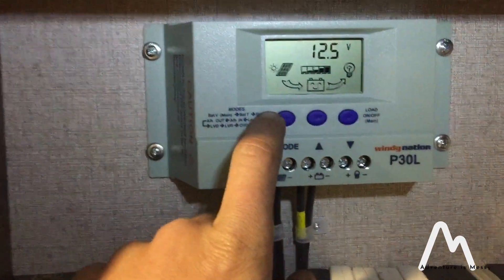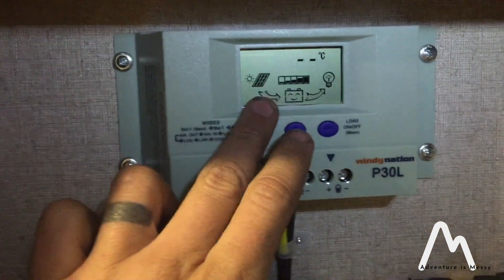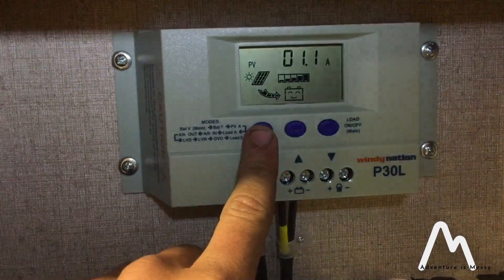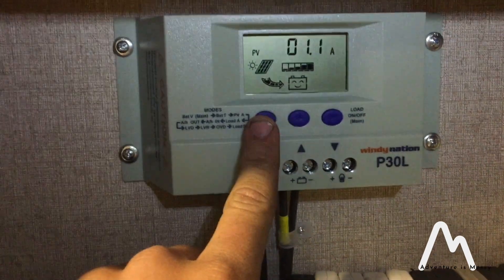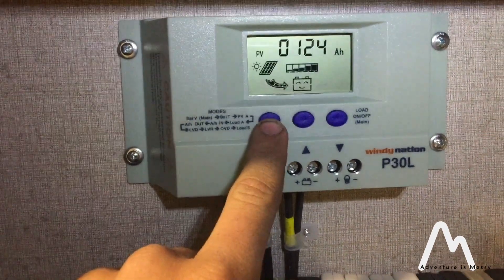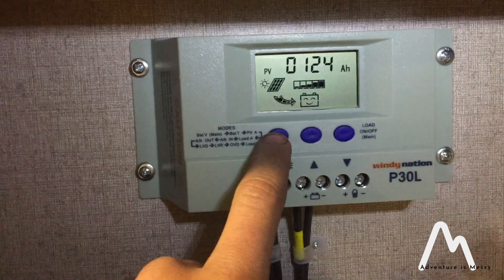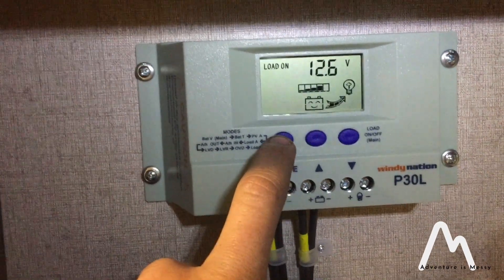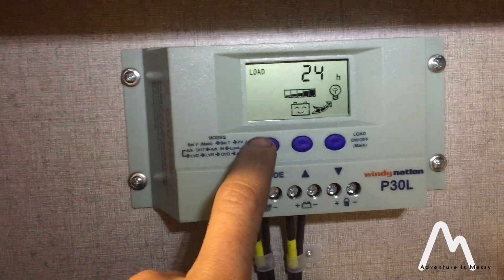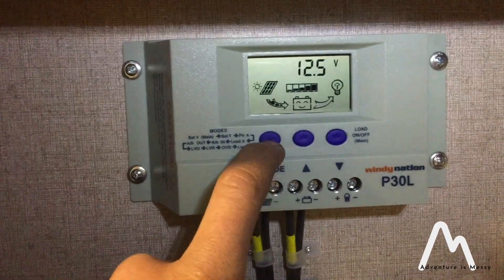You've got a lot of options through here. It'll tell you — there's an optional temperature gauge that you can put on the battery to monitor battery temperatures. And there's my solar coming in — 1.1 amp. I don't have anything on the load. There's my amp hours coming in off the solar, and a bunch of stuff I don't use. That's saying that the solar panels will stop at a certain point when the batteries get too full.